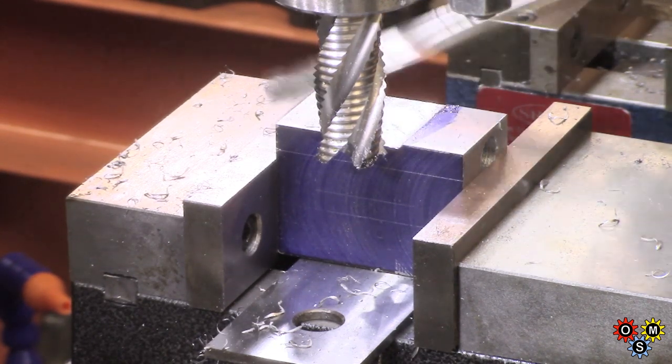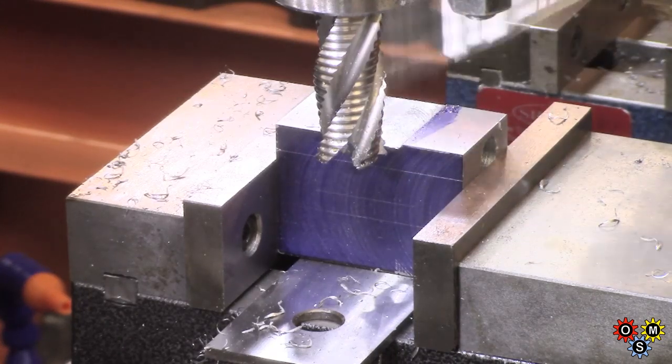I have got one two-flute, quite a new cutter. So I'll perhaps put that in at the end and take one to two thou each side to clean up if I need to. Just going to take a light cut and see how it behaves. As usual — be patient, lighter cuts, wear and tear on the machine and cutter. So we'll press on.